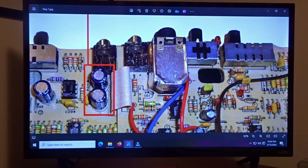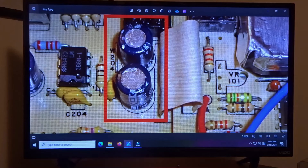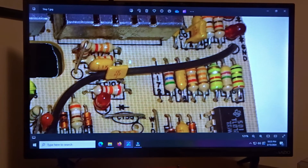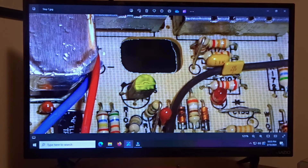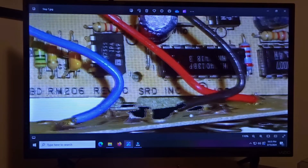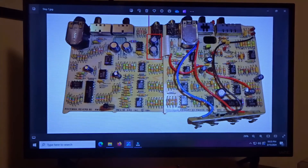Over here you'll notice your power indicator LED, power switch, guitar input, and your two headphone jacks. C1 and C2 — that's what Cyber Cow told me — even though it says W204, these are considered C1 and C2. You want to pull these out of circuit; nothing gets replaced into them. Looking at the black wire, you'll see GND which stands for ground. Behind the power switch and to the right side of the guitar input switch, the red wire connects to a positive sign, the blue one is negative. The ground goes to the middle and the red one goes to the right when looking from the very bottom.